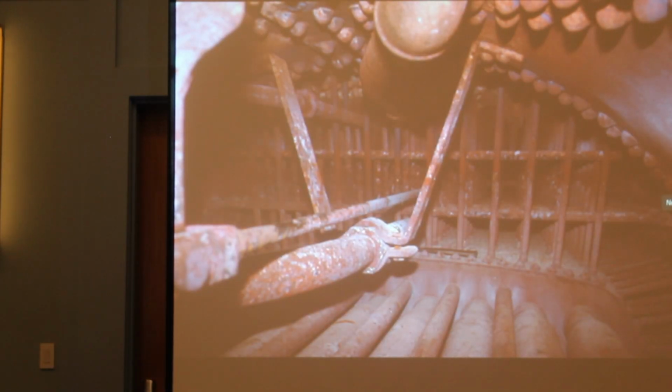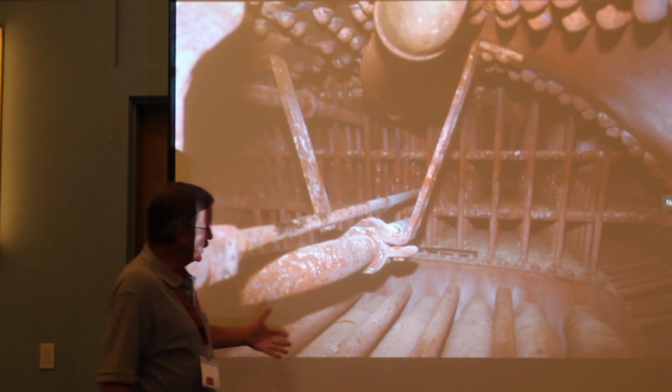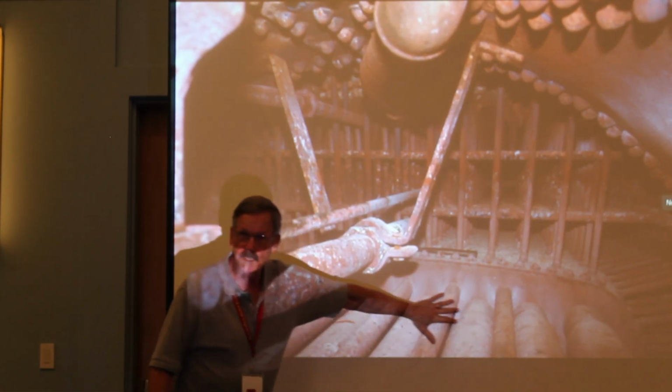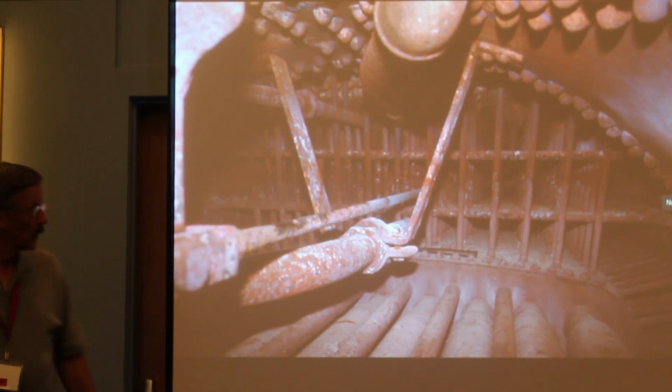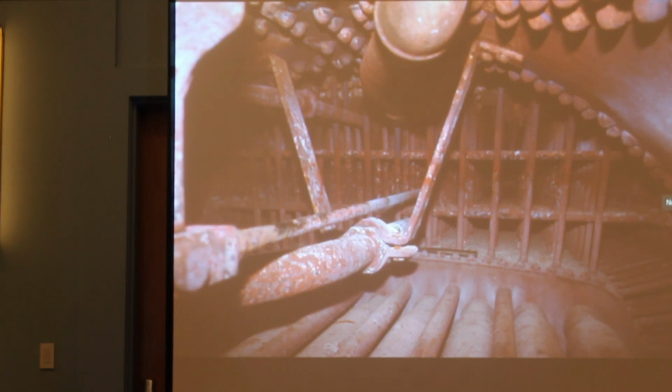That's a view inside the same boiler, and again, I want this because you can see, from the water side, how the tubes are laid out and how they're put in there. So yeah, safe end them maybe. Now at Strasburg, we never safe ended because you can electrically weld them, but it's a bugger to do, and it just wasn't worth it for us. We just take them all out and put all new ones in.